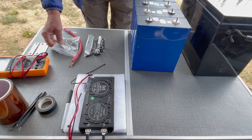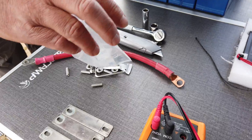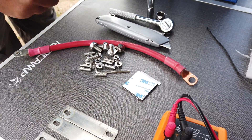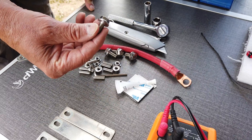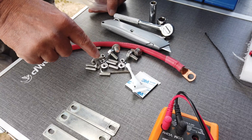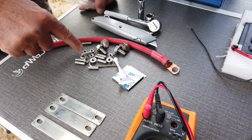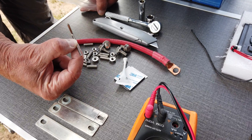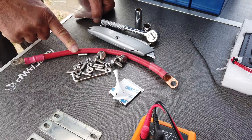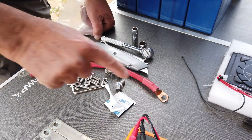These three bus bars came with the batteries. I also purchased a hardware pack that includes 3M double-sided tape, some lock-type glue, four 8 millimeter stainless flange bolts for the box top and bottom, eight 6 by 20 millimeter stainless grub screws, eight 6 millimeter stainless flange nuts, a 3 millimeter hex key wrench, plus a custom-made 12 inch 2 gauge jumper with 5 sixteenths and quarter inch heavy-duty ring terminals.